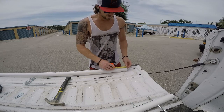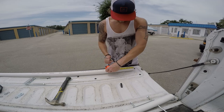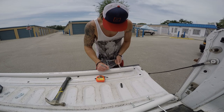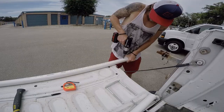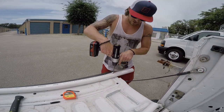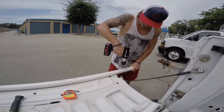Let's begin. We're going to get our measuring tape. See the writing? I'm going to go five inches up and make my first little circle with a Sharpie marker. Then instead of trusting my tape measure, I'm going to use the bolts to line myself up for the second hole — and that's where we make our circle. Time for the drilling. I've got a little leveler on top of the drill. Once I punch through the first end of the PVC, I make sure I'm level on my way down. It's not perfect, but it does help.